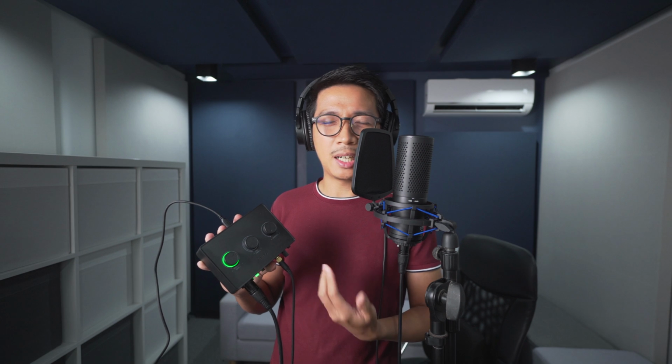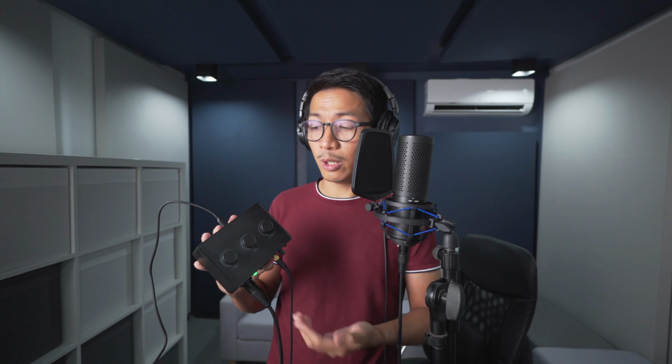So do I recommend the Fifine SC1? I absolutely do. Most content creators, streamers, gamers, voice actors, and even some singers will enjoy this audio interface. I wouldn't hesitate to use this for professional use, especially since it helps me achieve a clean and professional noise floor of minus 60 dB and lower. The only time I wouldn't use it is when a client requires 24-bit audio, which is crucial for post-processing. Fifine, please upgrade to 24-bit. We'd really appreciate it. But the raw sound quality coming out of this is perfectly acceptable in many use cases.